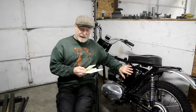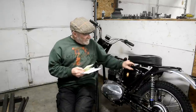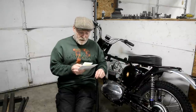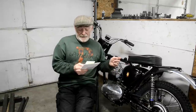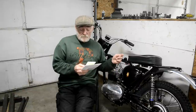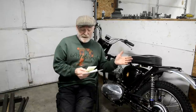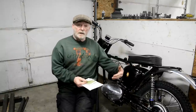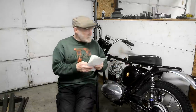So there's lots of air getting into the air box. I measured up the gap around there. It was like two oblongs and a triangle shape at this side. And that came to 4,500 square millimeters. That's nine times as much area of air coming in as there needs to be going through the carb. So don't worry about it, lots of that. So that was that done.